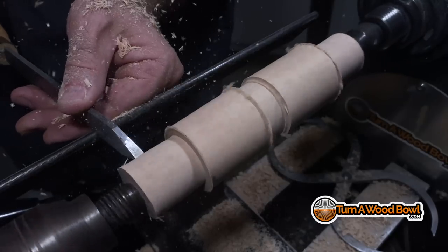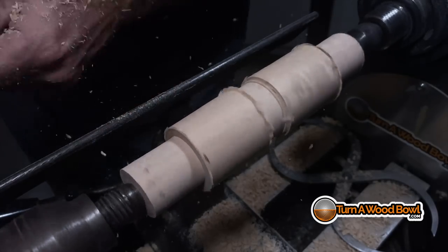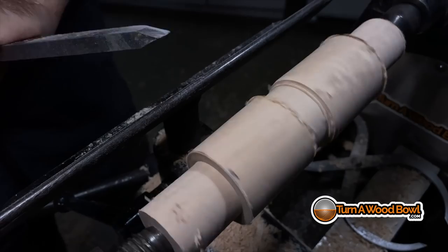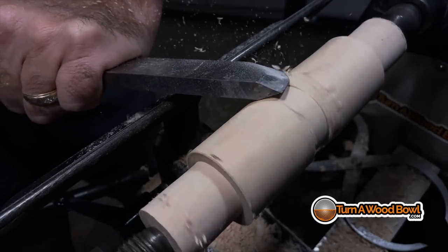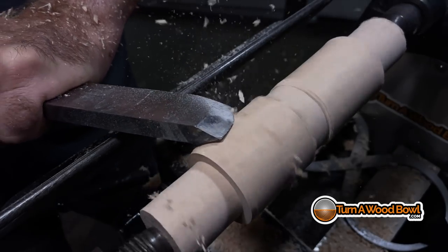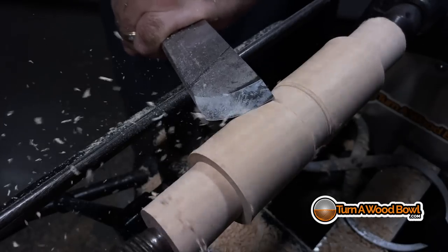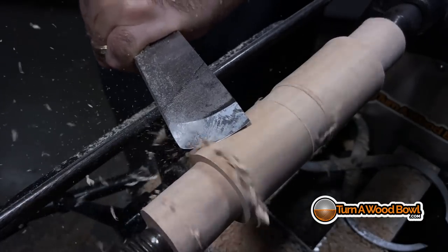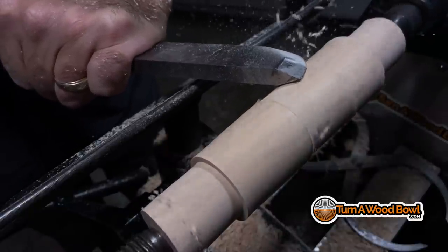In spindle and end-to-end turnings like this you can get up to two, three, or four thousand RPMs without any problem. If the piece comes off, because it's rotating at such a small center of axis it typically will just drop. Whereas a bowl turning at those high speeds — with the outward centrifugal force of the diameter — can be very dangerous and come off flying at speeds above a thousand RPMs. Under a thousand RPMs with a bowl, if it comes off the lathe it'll probably go down toward the ground. Above a thousand RPMs it can go straight up at you or into the ceiling, and I've seen it happen.